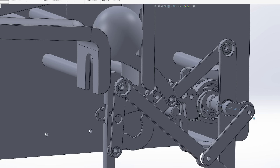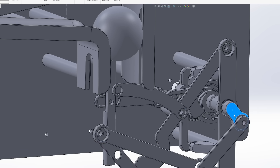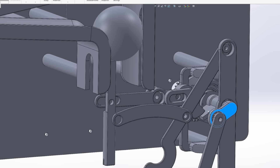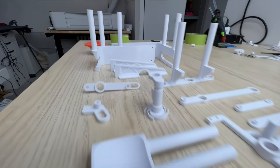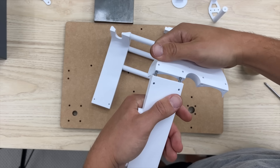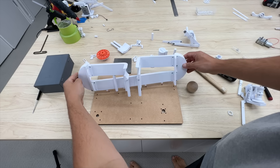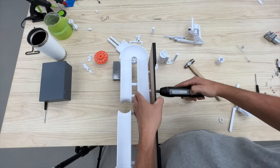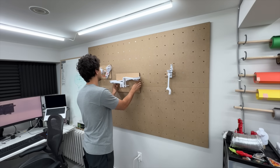As that does one full revolution it's going to push the ball all the way up, deposit the ball at the top of the track, then drop back down and get stopped again by the escapement latch, which returns to its position because of a spring or something — haven't figured that part out yet. With the basics working I decided to fully commit: print out all the parts, laser cut the back plate. The track is made up of segments connected with little dowel pins, and the whole thing screws into the back plate.